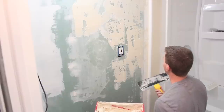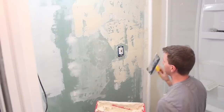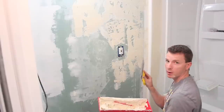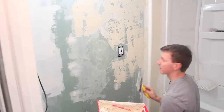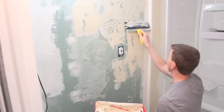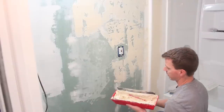The next thing you want to make sure you're doing is getting a nice smooth finish. You can probably see in here I've got some lines. A lot of these little lines, strokes, and little lumps from the edge of the blade — you can sand those off afterwards. So get as smooth as you can beforehand, mostly just by barely touching with a nice light touch on there.